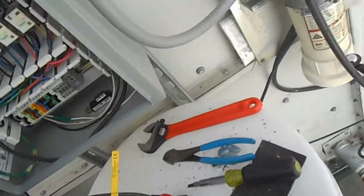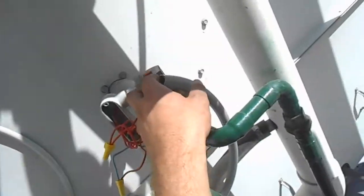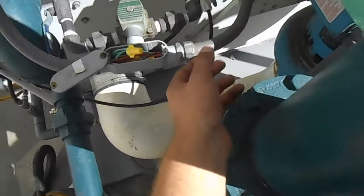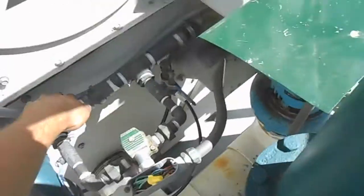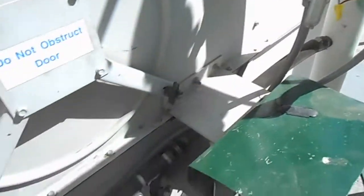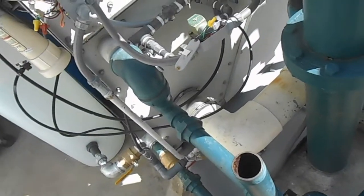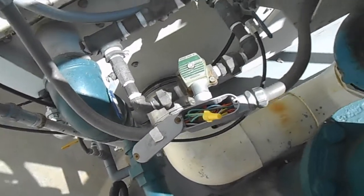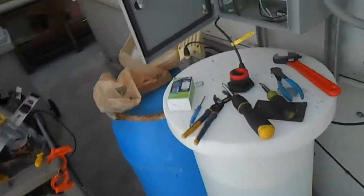That's it for today — it's about time to go home. Tomorrow I just have to take this existing flex tail off of here, plug it right there with a screw plug, take this whip off, and just run from our control panel straight over to here, bypassing those heat valves. If I was feeling real perky I might just make this a full elbow and get rid of that T-box there. But I think the plug on that end would be just as nice — you don't have to mess with anything.